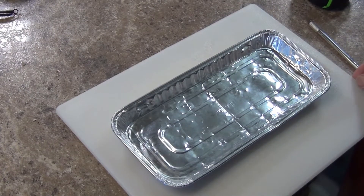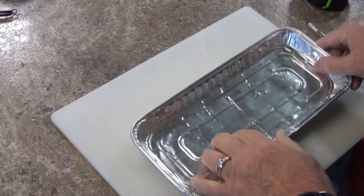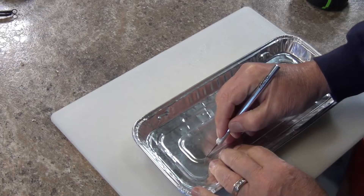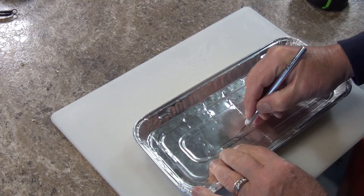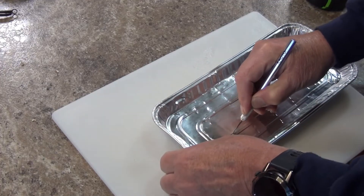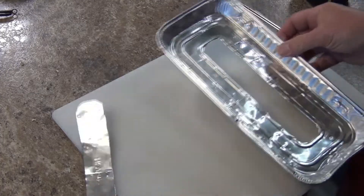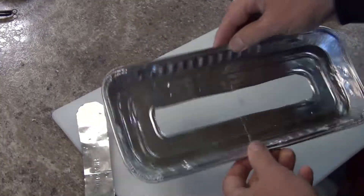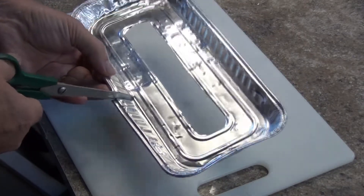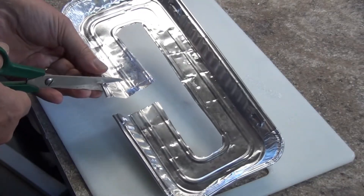To start making this into an antenna, I have to remove some aluminum from the middle section. There are raised ridges in the pan already. All I need to do is cut out the aluminum from the inside ridge. I use an X-Acto blade to carefully cut along the inside of the ridge and remove the center section — being careful of both the blade and the aluminum, as they both can cut me. Next, I use a sharp pair of scissors to cut a section out of the bottom side of the pan, roughly in the middle of it. I'm removing a ¾-inch piece of aluminum.